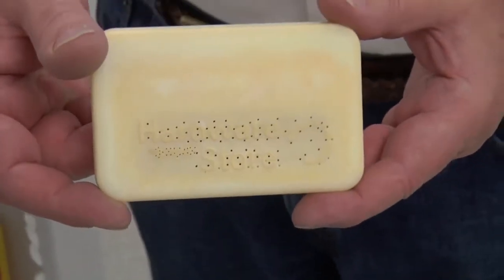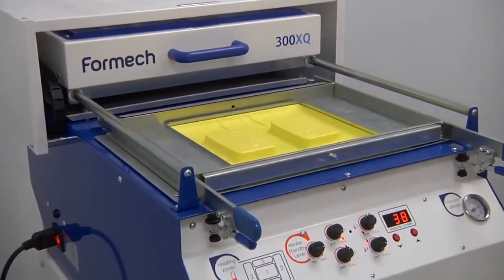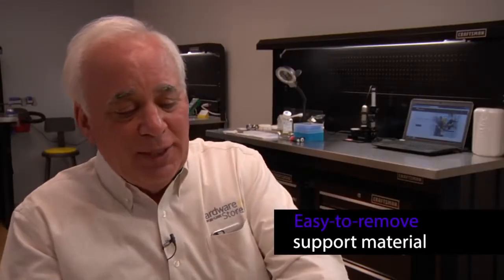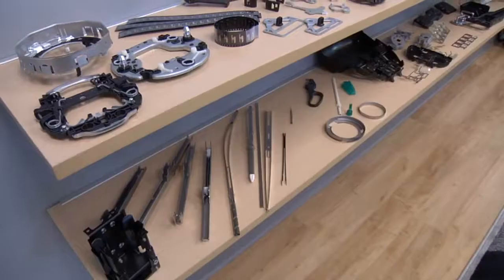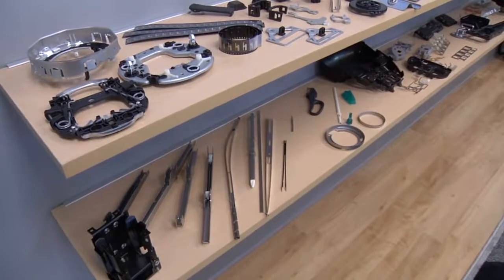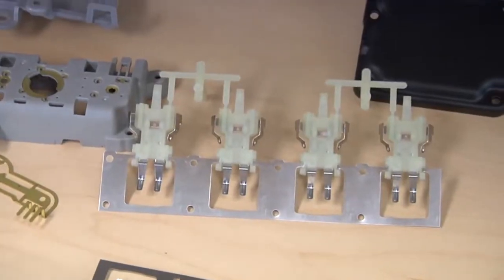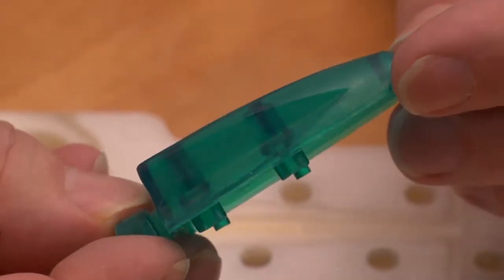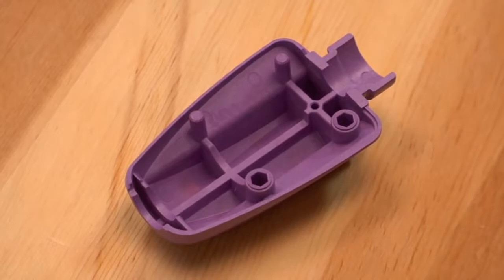Because of the support — the wax material — we could heat it up and bring it out. We can get any detail we want. We don't have to high-pressure wash them or anything else; we just melt it out. So any detail we want in these molds, we don't destroy it trying to clean it. Any part that we would want to do, we've been able to do with printed tooling. We can do things in printed tooling that would be very complicated in steel, whether it's inserts or undercuts. It allows us to create things that you would have just imagined.